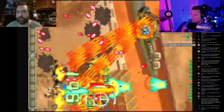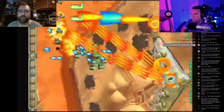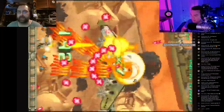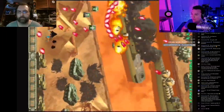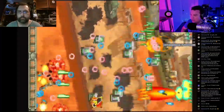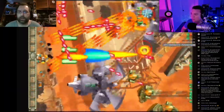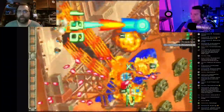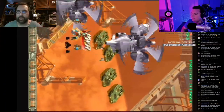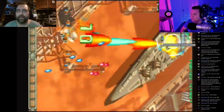On donor-based conversions, 3.3V chips are run at 5V for the I/O, which Fluffy's boards fix. Everything on his boards is at 5V — no level shifters needed, all kosher, and it's all going to keep working. Right now Fluffy's PCB covers games that don't use the custom ASIC for encryption. Unfortunately that's a lot of the popular carts — Gladiator, Martial Masters, Demon Front — you can't make those with his repro yet.